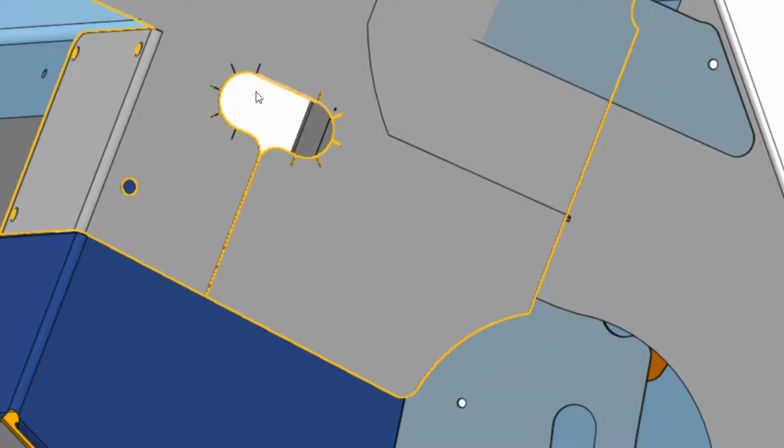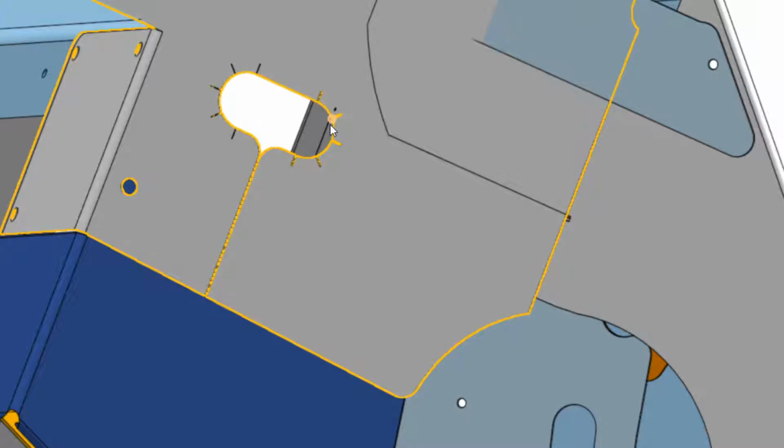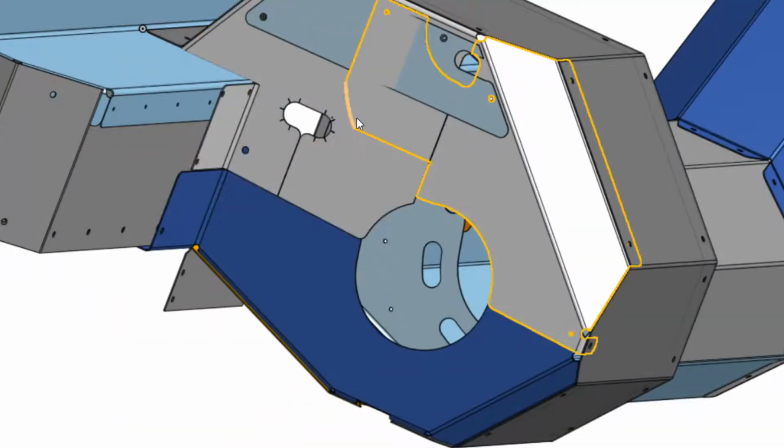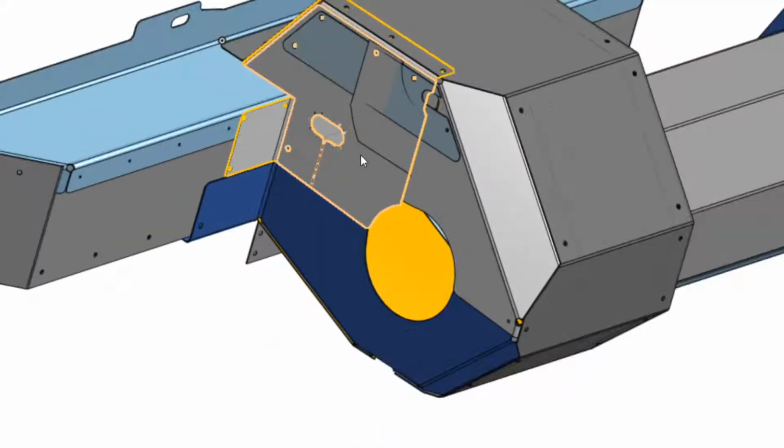So I would put that on to try to prevent any dust coming from the left side here, the radiator fan, from being able to blast in there, because right behind there is the turbocharger compressor or exhaust turbine, and that's about the hottest spot on the whole machine. So button this spot up if possible. So that's the first piece shown outlined there.